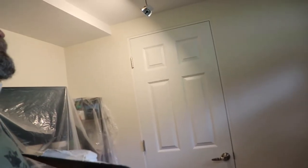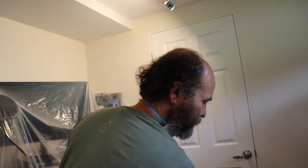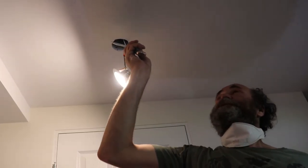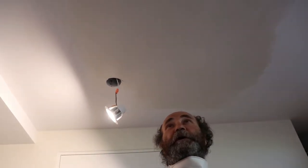This mud is a little bit harder. The reason is that when you do it at the same time it can shrink a little bit — if you have it harder, less water, less headache, and it looks better. So here was one coat of concrete fill and now I'm doing the mud. If the place is not flat enough you can do two coats of concrete fill if needed. I have the mud in there — what I'll do is scrape most of this mud again to eliminate fisheyes, then scrape it and reload. The hard mud is good for this, but if you have to work the whole day with mud it's better to have it a little smoother so you don't get so tired. I have one coat on — as you guys can see it's already smooth — and I'm just gonna put another coat on top right away. On this coat I leave a little bit more mud so I have enough on top of the concrete fill to do my sanding.